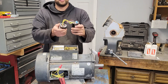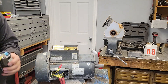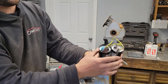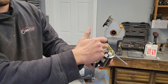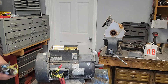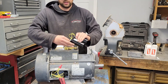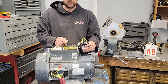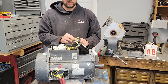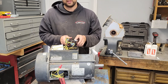If you're making these cap banks, you're going from this terminal to this terminal, this terminal, this terminal — essentially just making connections on the opposite sides. Then reconnect. You want to make sure that your two wires going into the motor don't connect to the same jumper — you want to catch the other side of it, otherwise it's just a direct connection. If you open one of these up it'll probably make sense to you.